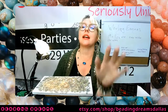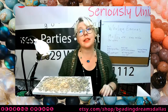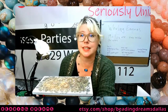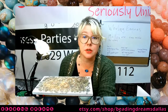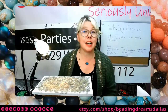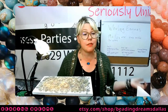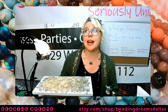Right, if you're not actively soldering with your torch, turn it off. This particular torch especially is very easy to ignite and very, very easy to extinguish. There's literally no reason to leave it burning if you're not using it. And God forbid, if it were to be burning on your workspace and then get bumped off, that's a whole world of trouble that you don't really want at any point in time.